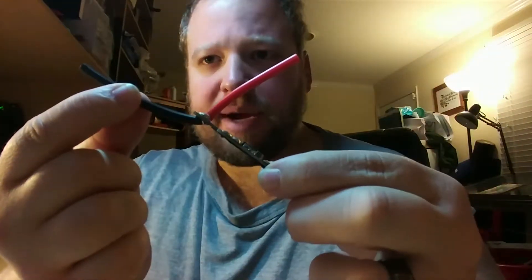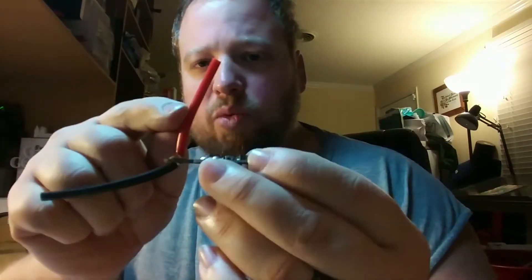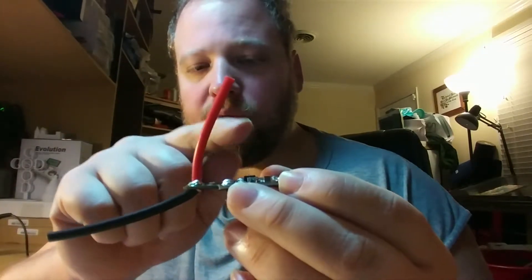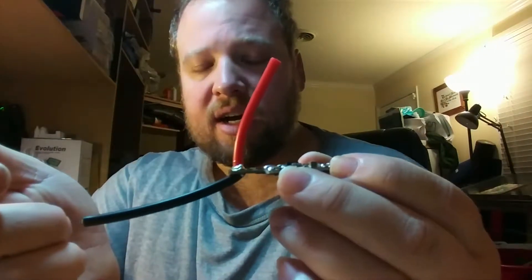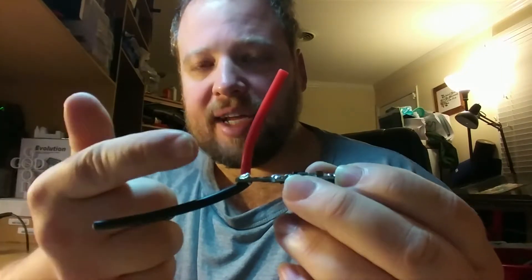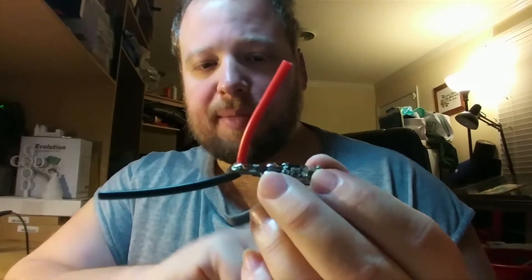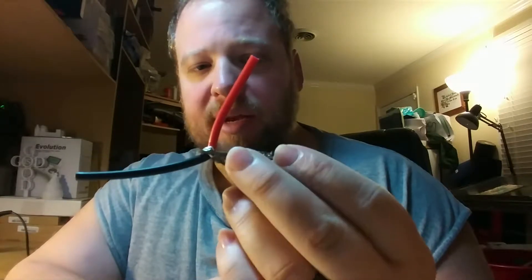A few things breaking in a crash could be the point of just replacing one component versus replacing all your components, so don't be scared of the black tape. This wire going straight out to the battery into the PDB - this wire is actually going to be the power that goes from the flight controller to the PDB, because with the Pro edition it has a current monitor, so you have to feed the battery into the flight controller first.